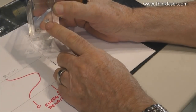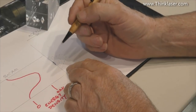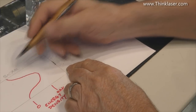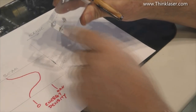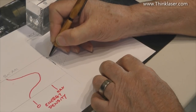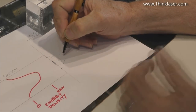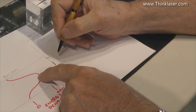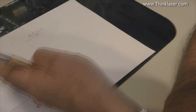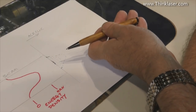We can see that erosion there - they're all over the place where I keep testing things. As we saw in the hole we made, after a certain period of time - note I'm using the word 'time' - there was enough time to allow even the low-energy part to start heating up the edge of the material. That was just enough temperature to keep that part in its liquid phase, whereas down here there was enough energy to push it through its liquid phase and make it disappear into vapor.